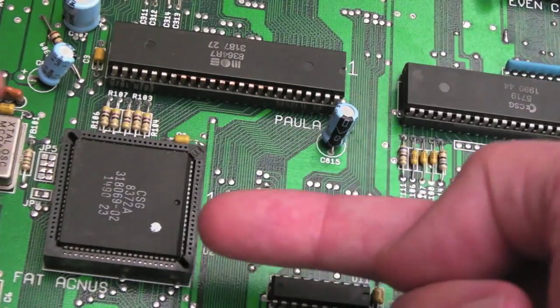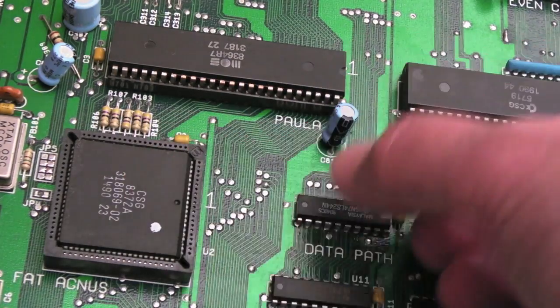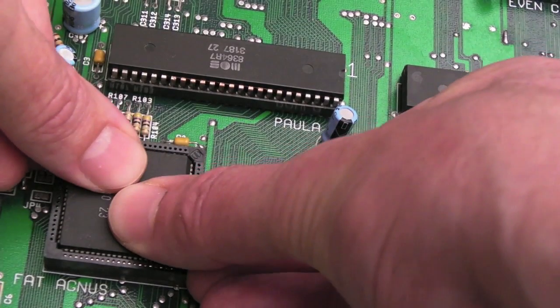The technique here is to get it perfectly lined up and inspect the pins before you put it in, because sometimes they can get slightly bent to the sides in transit when they've been stored in incorrect containers and knocked around. Make sure all the pins are straight, get it nice and straight like that.